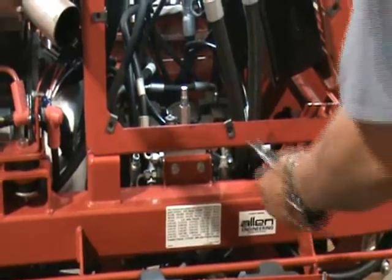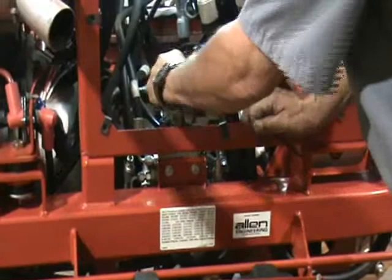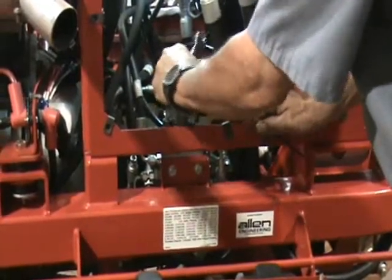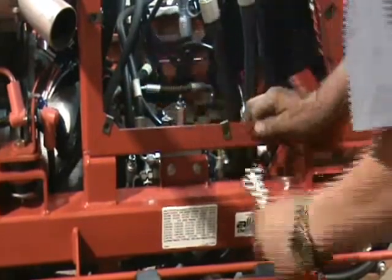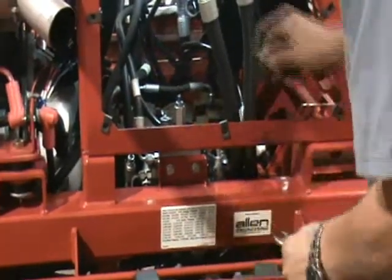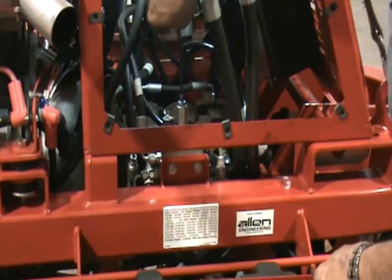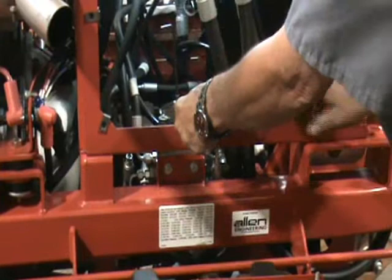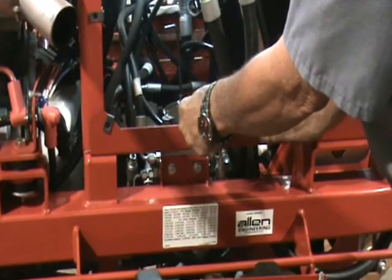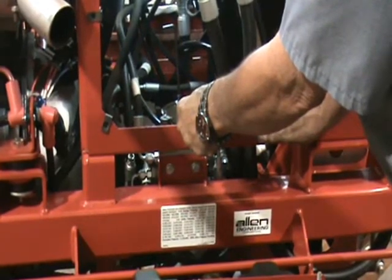What we're doing now is removing the cap on the high side of the unloader. Note that on your pump it comes with 4,000 PSI reliefs. You can adjust your rotor speeds, but you can't adjust your pumps — you just have to change out the reliefs if something's bad. These pressures actually help tell us what's good and what's bad, which is why we recommend them.